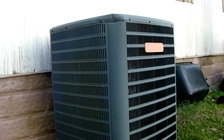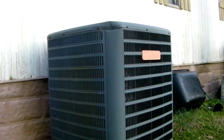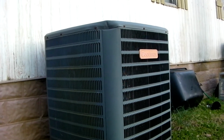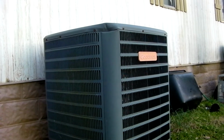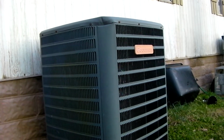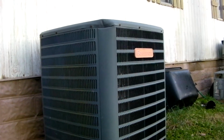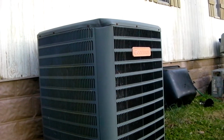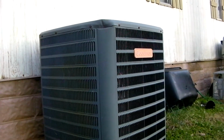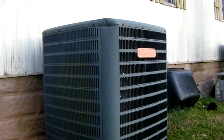And from my knowledge, pretty much all Trane units, and I think Lennox, offer demand defrost. Some Carriers might offer it, I'm not sure, but I think Carrier is one of the brands that does time temperature defrosting. So you have Carrier, Goodman, you have Goodman Air, among other different brands. Many brands out there, to this day, are still using time temperature defrosting.